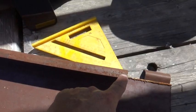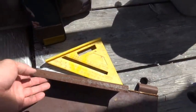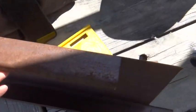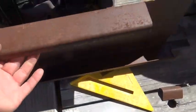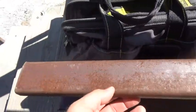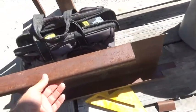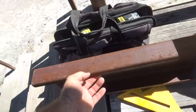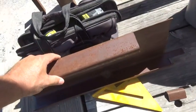I am going to cut this out with my metal cutting wheel and my 4-inch grinder. I am going to cut this notch out here and this one out, then I am going to turn it over and cut down this whole side along that line. That will be my piece. Once we get that piece cut out then we can figure out where our holes are going to be. I am going to let you follow along with me as I cut this thing out.